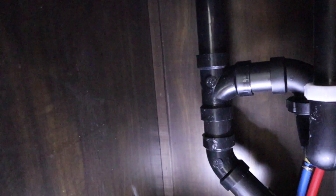This is the other side — directly underneath the sink — but it's the same kind of setup. We've got a corner bracket here and one down here; the lighting is terrible, I know. The backing plate we're going to cut goes right here as well, and it's the same seventeen and a half inches of one-by-eight material. So we're going to cut two one-by-eight pieces, each seventeen and a half inches long.